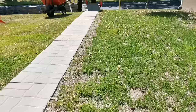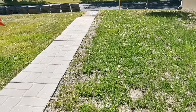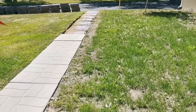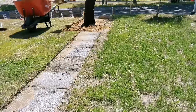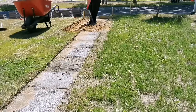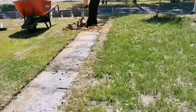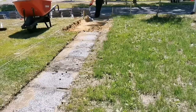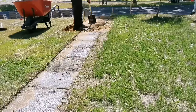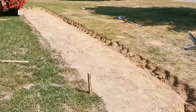So here we are ripping up all those old patio pavers to redo it. I like to dig down about six to seven inches — about the depth of your shovel. Take it down until you hit good compact ground. You'll be able to tell when you've gotten through all that topsoil and hit harder ground — about six inches.